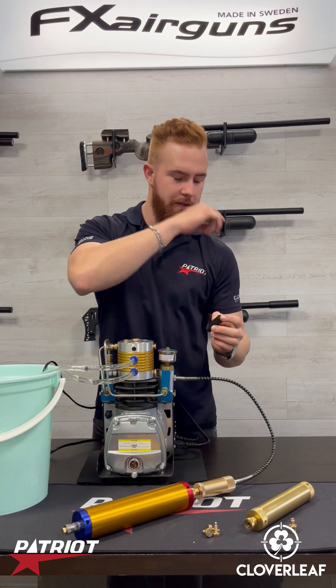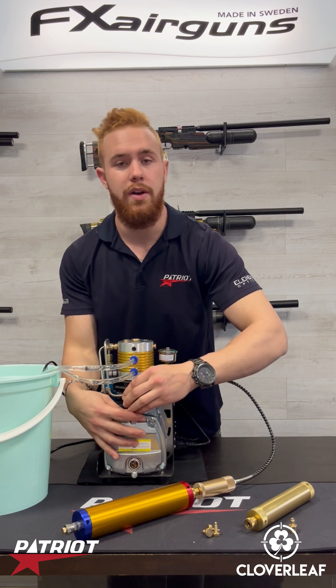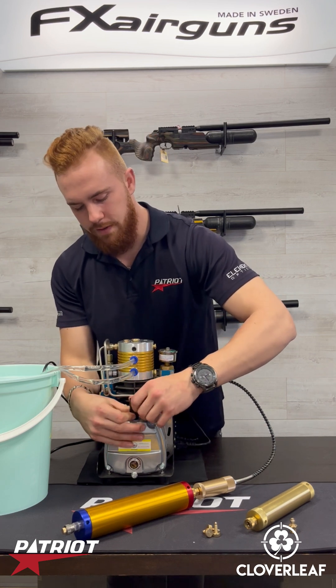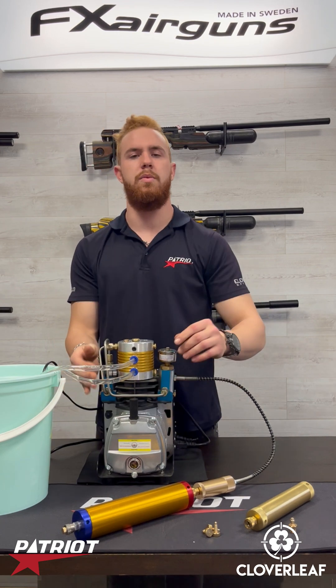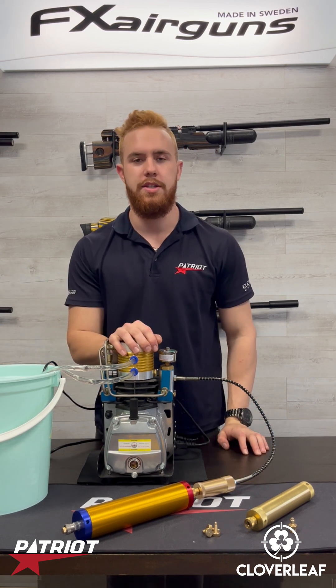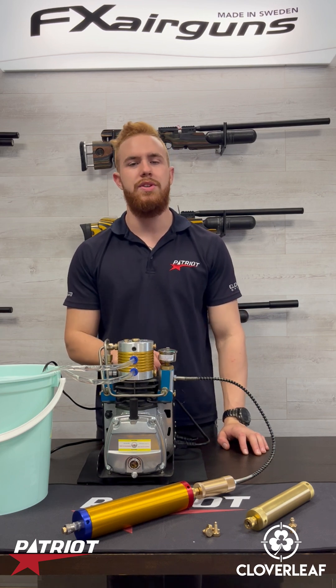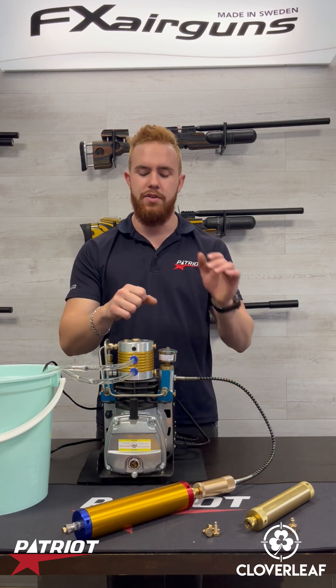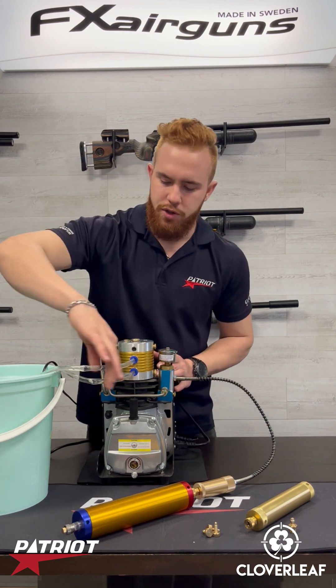Make sure you connect the small filter on the front — quite simple. We've got our oil in, close it up with a nice hand tight, and we're good to go there. From there you'll see I've got a bucket here with water — just half a bucket of water — this is the cooling system. Keep in mind these compressors get very hot. Try not to exceed a temperature of 65°C. As soon as you hit 65, stop the compressor, let it cool down, and then charge up again.